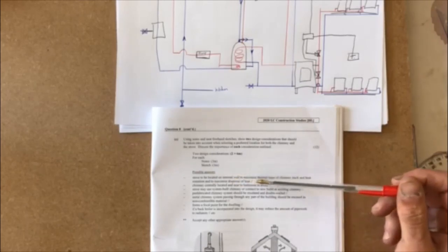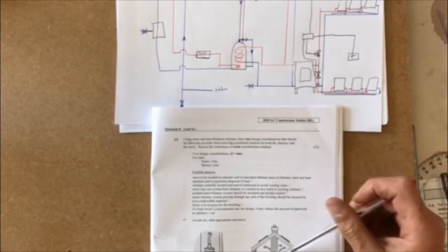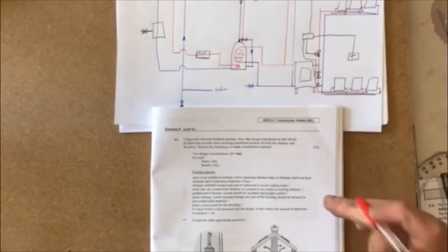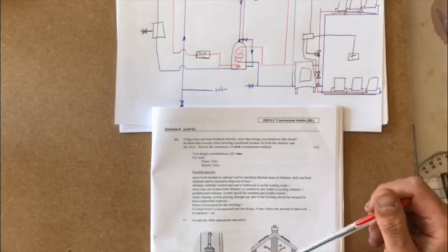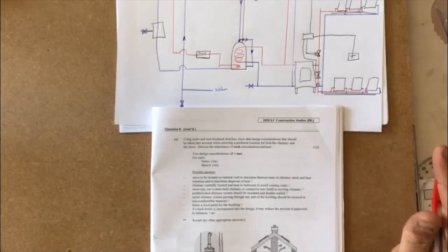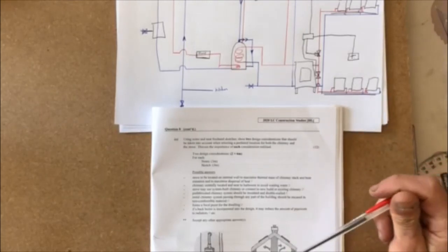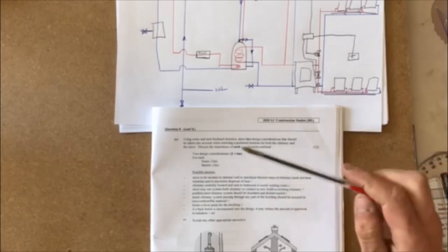Okay, so that basically means keeping the stove on an internal wall, because that way any heat going either side of the stove is going out into the rest of the house, rather than if you have it on an external wall, it's going out. Mind you, it seems more common nowadays to have them on an external wall for aesthetic purposes, that they're away out of the place and they don't take up space. But from an efficiency point of view, you're better off having them in the middle of the house because the chimney stack will heat up and release heat back into the rooms.